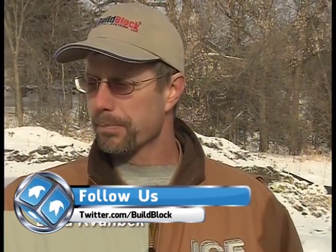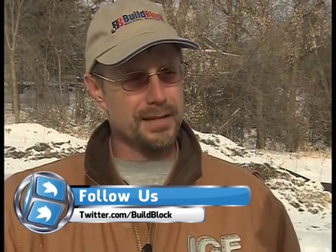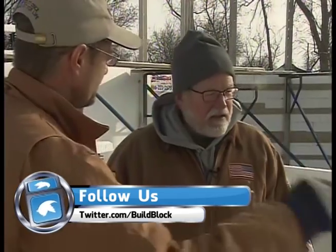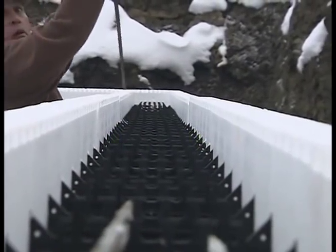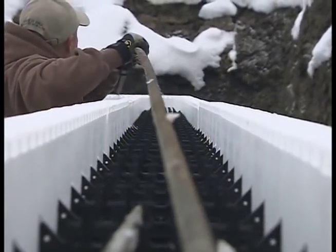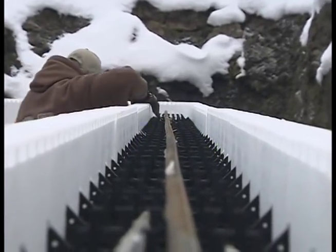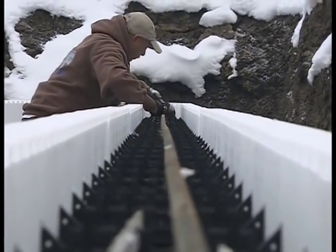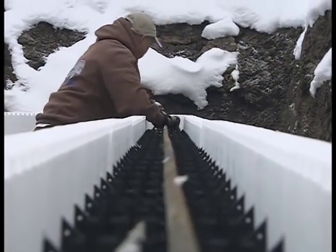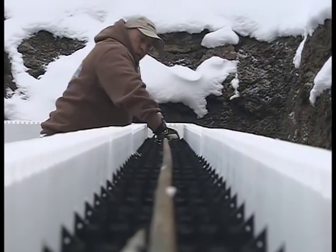Yes, we have to put them together in a way that will withstand tons of pressure of concrete when we fill them up. There's a lot of rebar going into these things — lots of rebar and special stirrups for the brick ledge, plus lots of horizontal and vertical rebar. The nice thing about the plastic webbing is you get that rebar exactly where you want it in the middle of the form; you don't have to worry about it drifting to the front or back, which doesn't do you nearly as much good.